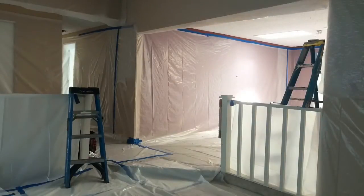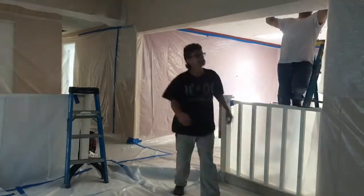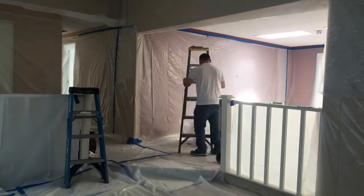As you can see, we're hanging poly right now. When they get done hanging the poly, they'll come in here and start the work. We have negative air machines pulling negative pressure on the containment, so the idea is that while we're doing the work, we're trying to keep all the fibers inside this work area and the air is being filtered out through a HEPA filter.